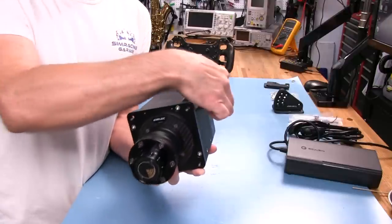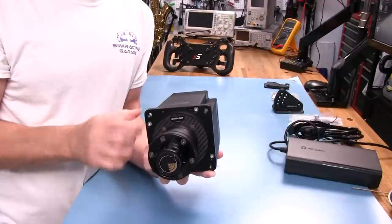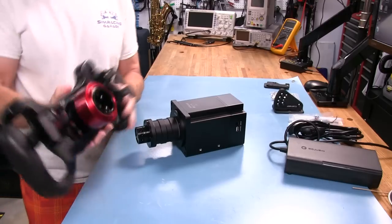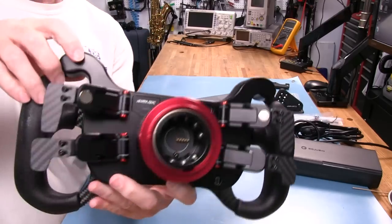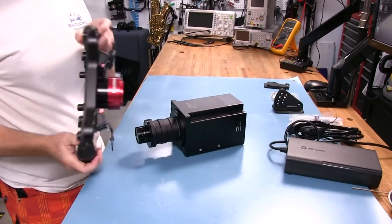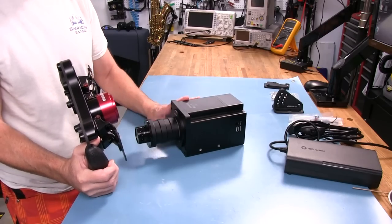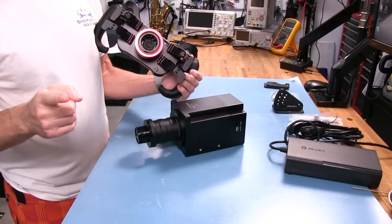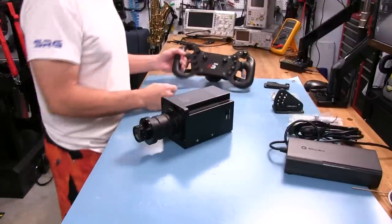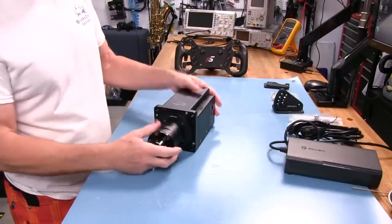This solution — having the transceiver right up front — is probably the best way to go. Yes, you have to have a special pathway or tunnel to run wires supporting this front transceiver, and SimMagic obviously designed that into their servos. The SimMagic wireless wheels have their wireless transceiver up front sitting right where this one is. Even when you're turning, it stays in much closer proximity than something sitting in the back trying to get around metal casings. Kudos to SimMagic for using that in their servo motors and their M2.